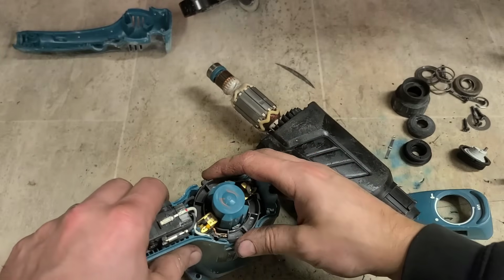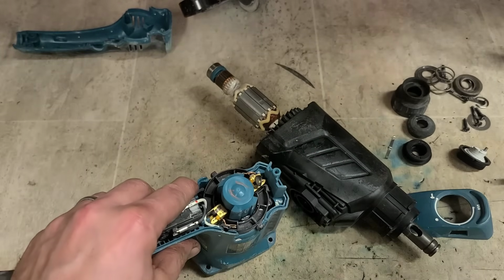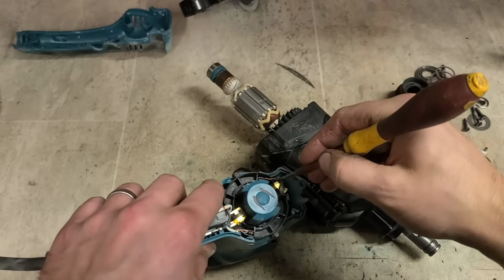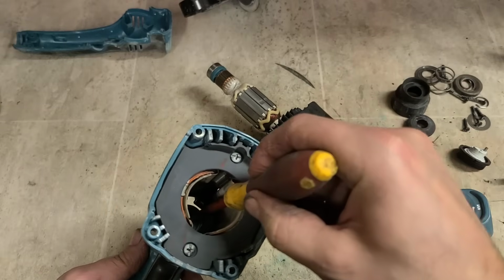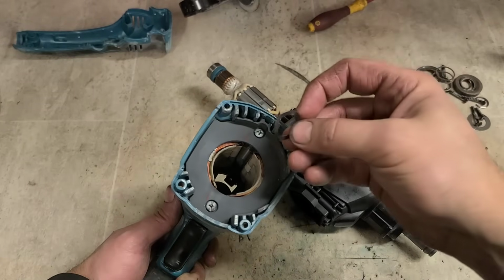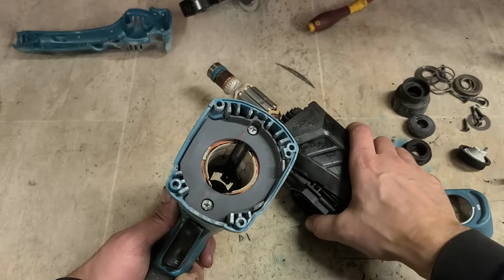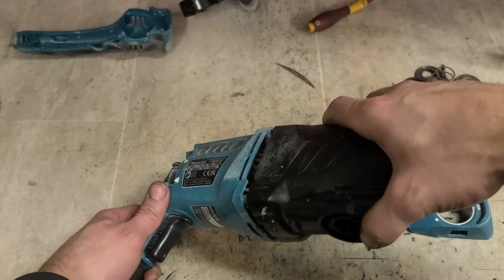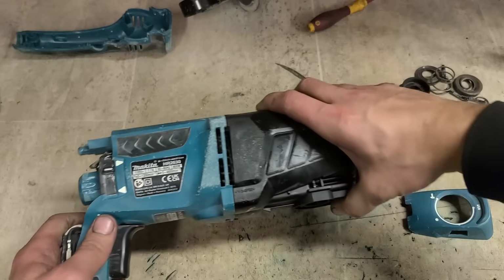You need your steel ring. Also need to disengage this brush. It's down too far. Just look inside in case the brush is sticking down, snagging in the armature and break. Drop on that little wave washer, and drop that on.